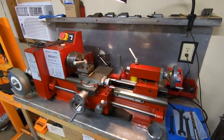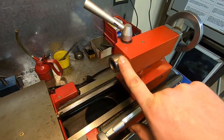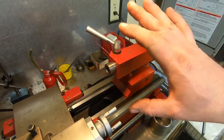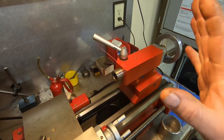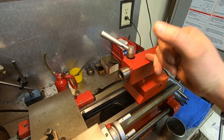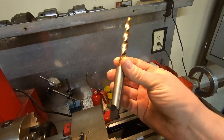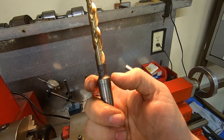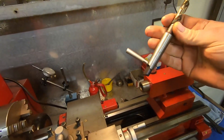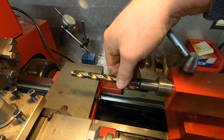To illustrate that point, we'll come over here to the tiny little bench lathe. Look at the tailstock piece here — this is a Morse taper. It's a standard multi-sized taper fit for tooling in machines like this. This is a number two Morse taper. I believe it goes zero through seven with a four and a four-and-a-half in between. We're just under three-quarters of an inch diameter at the large end of the taper. The way this works, there's no keyway on here — this is just basically a friction fit.